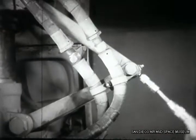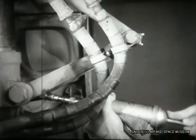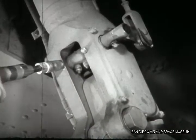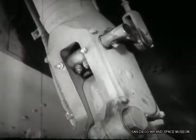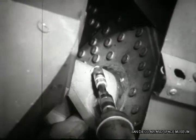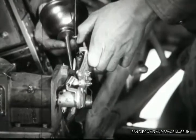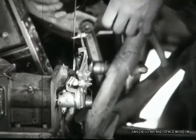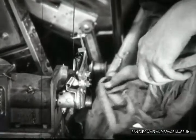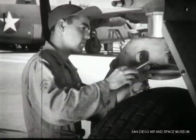On the main landing gear, Williams greases the big scissors, the landing gear latch, and the upper drag link fitting. They use oil of the correct specification on the nose wheel door emergency relief, making sure to wipe off all excess oil. On the main landing gear, they oil the fairing hinge and the fairing links. This completes the landing gear inspection — on to the wing flap check.